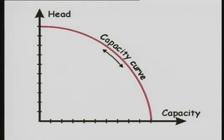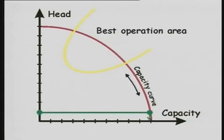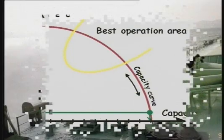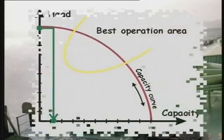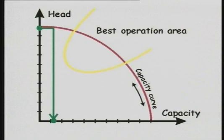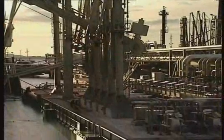The capacity of all centrifugal pumps varies very much with the head, or the pump's back pressure. If the head is very low — for example, when pumping just over the rail — the capacity is very large. But if the head is very high and goes to maximum, the pump capacity goes to zero. In order to have a successful discharge of homogenous cargo, try to avoid too many bends and T-pieces and never use valves and pipe diameters that are too small.